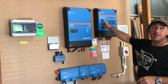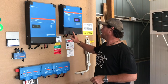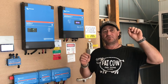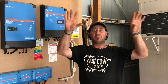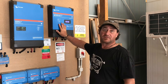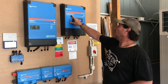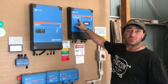The 450 represents 450 volts. This particular unit has got two strings or two lines coming in. Imagine one bank of solar panels and another bank of solar panels — that's two separate strings, strings one and two. They come in to this and regulate your solar charge, as per any normal solar controller, and the 100 represents 100 amps.